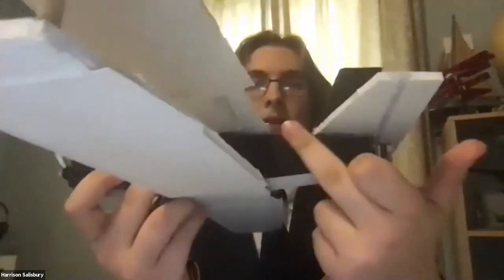And did it affect the plane's turning ability by having your ailerons close to the fuselage as opposed to out on the wings? It's not overly affected that much with the difference. It was better for the leverage of the servos, since the servos are mounted in the side of the plane, to have as much of a parallel line with the arm and the control surface to get the most leverage possible with the control surface.